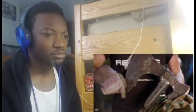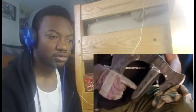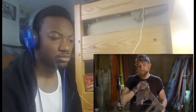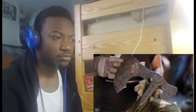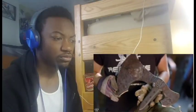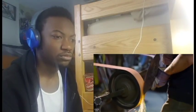So I did a lot of perimeter grinding last night on this axe. Got it to the right shape we're going for. Ilya forged these lugs out of wrought iron, and then he punched three holes on either side. The next step for me is to edge it. I already beveled some on the back blade here, but I haven't done anything on the front. I'm going to go ahead and finish that up, and then I'll hand it off to Ilya, and he'll get those runes carved and inlaid.